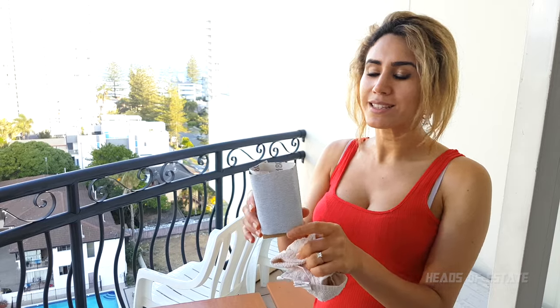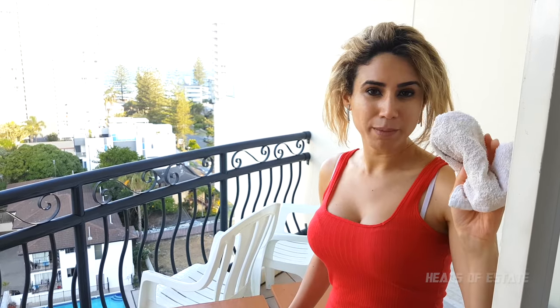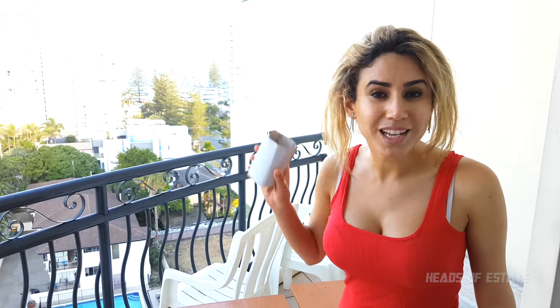My energy levels have fallen a little bit, so we're going to take a brief break for some fresh air. Well done for completing the first step of cleaning your cupboards and preparing them for the next step, which is the sanding. All you're going to do now is get 180 grit sandpaper and sand down all of your surfaces, then wipe them clean with a clean cloth. You're then ready to apply your first coat of primer. I'm going to sand down all surfaces including the edges.